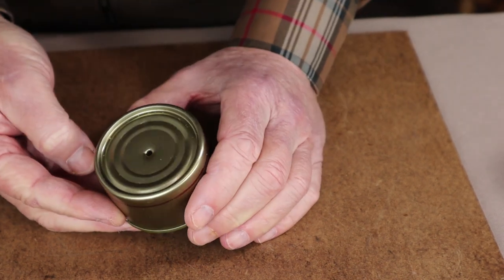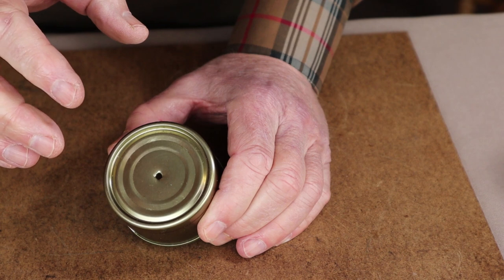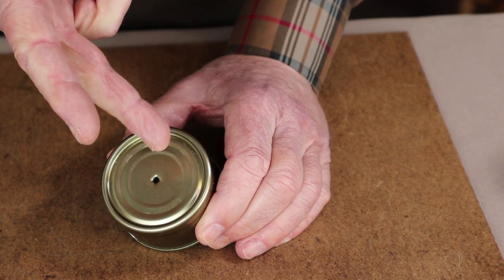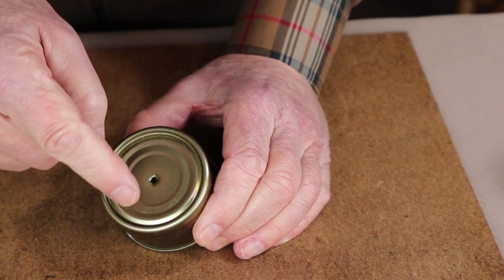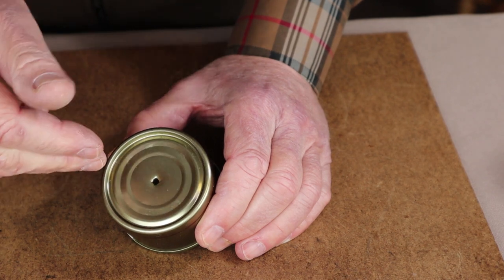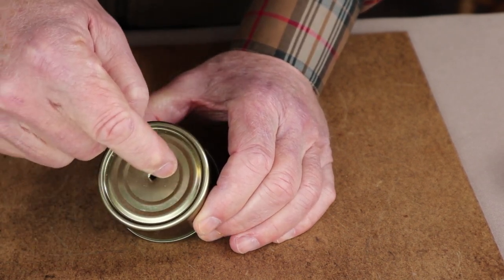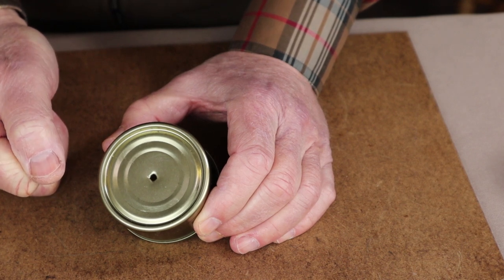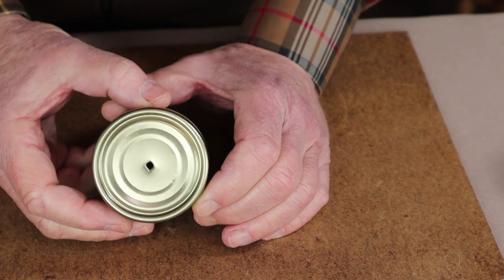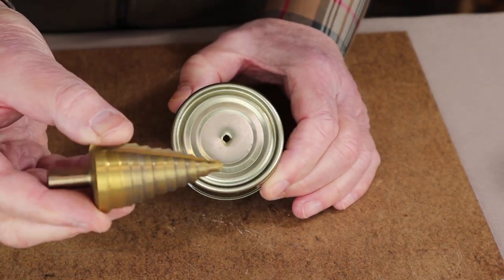If you don't have the tool I'm about to show you for cutting the center hole, you can measure and mark the diameter you want from the center hole out, then use shears to create a series of lines coming out from the center — it ends up star-shaped — then take a pair of pliers and work the metal back and forth until it fatigues and falls off. The challenge is you'll have ragged edges all the way around, so you'll need a file or a Dremel with a sanding stone to smooth them. What I'm going to use, because I have them, is a step drill and a cutoff wheel.